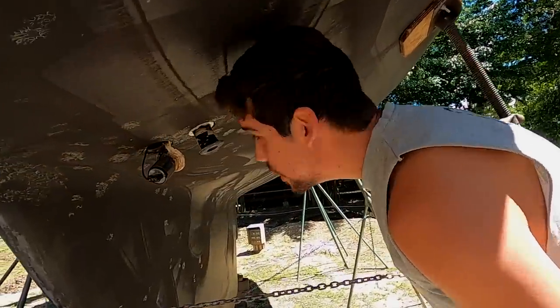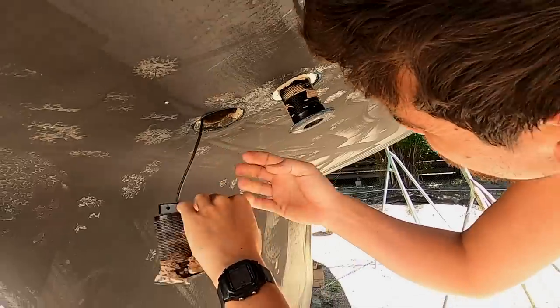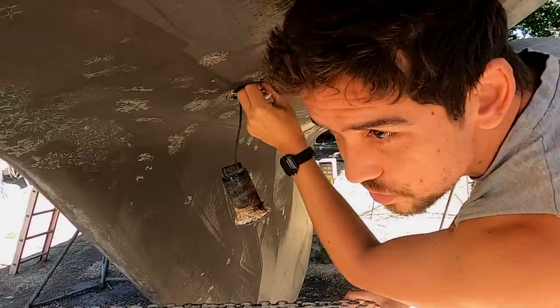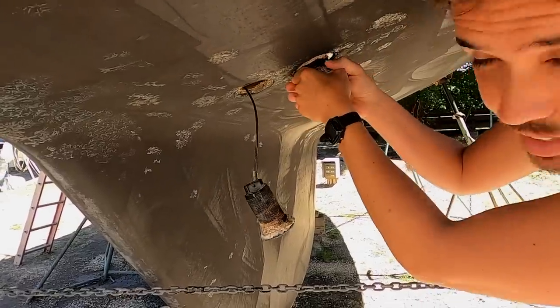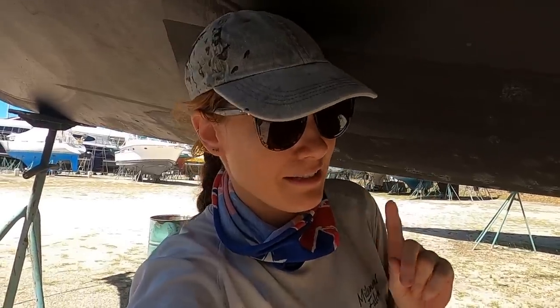Hey. Goopy. Yeah. No shortage of goop. Sealant. Wonder if it's 4200 or 5200. I think it's 4200 because it came out too easily for 5200. I wouldn't personally use 4200 here. 5200, you mean? 5200, eh? I don't see why anyone would use 4200, period. You mean 5200? 5200. It's early. Stop it. Just to clarify, we're meant to be using 4200 because it's meant to be a semi-permanent bond, not permanent, which is what 5200 sealant does.